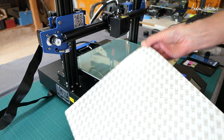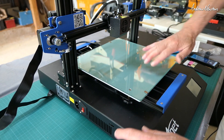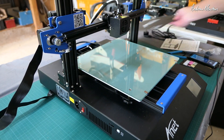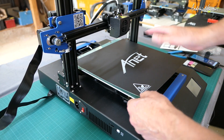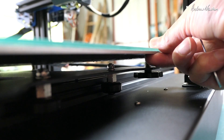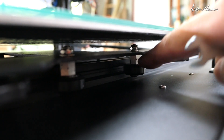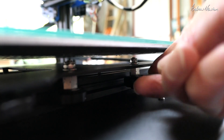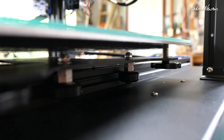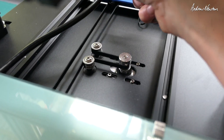Now I can stick this on straight onto the aluminium or we can use the glass. The most reliable method I've found is to use glass and put builder's tape over it — this blue stuff — and there's no problem sticking to that and it's easy to get off as well. The glass and the mat seem to work very well for the first month or so, but then it just starts not sticking so well. So eventually you'll probably end up using builder's tape. Now you need to check the base for wobble and how tight the rollers are. These two rollers here on the right hand side have the adjustable nuts; mine was quite wobbly and you just adjust these nuts until the wobble goes away. That's running quite nicely now. The belt tension can also be adjusted by moving this motor in and out, but that's feeling pretty good so I'm going to leave that as it is.